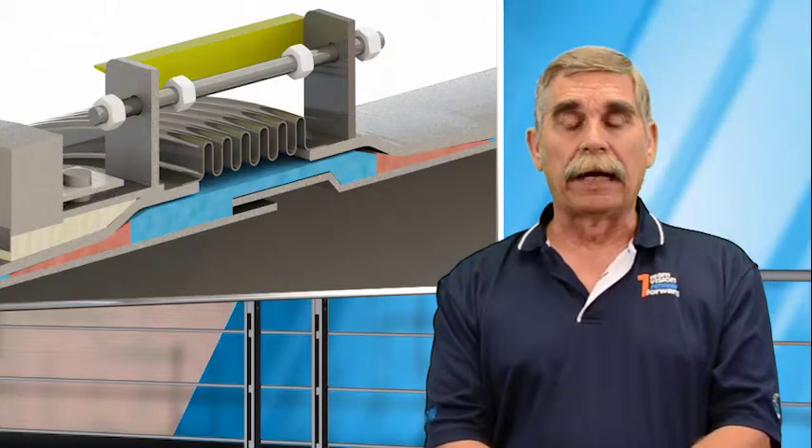So you may want to take a look at that. Also I've seen failures of rounding rings and fit-up rings that were left over from initial construction that were never removed, and they're causing this through-wall fatigue cracking.